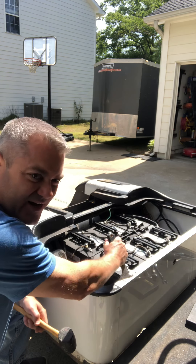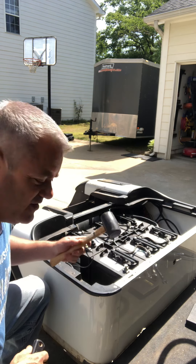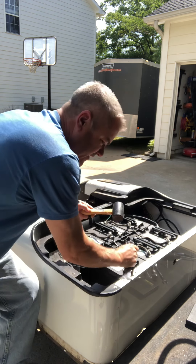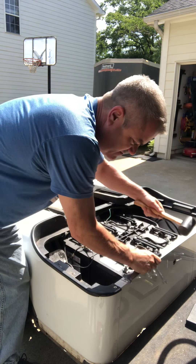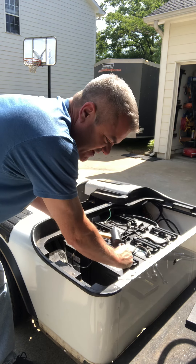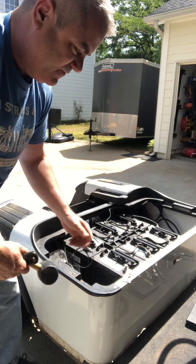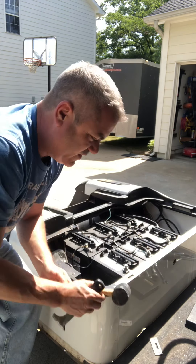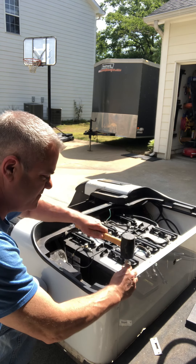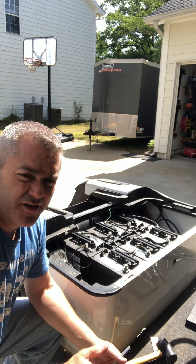...is you've kind of minimized the integrity of the rivet on the top. So you just want to give it a few pops — you'll see it as it goes. You can actually see it break, and there it goes — the top part of the rivet is off. Then you just take your punch, and there it goes. That's it, pretty easy stuff.